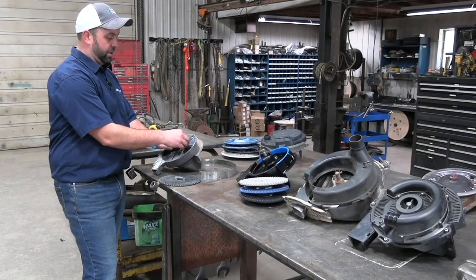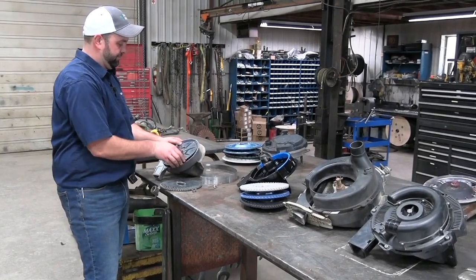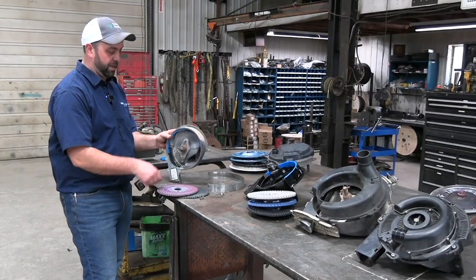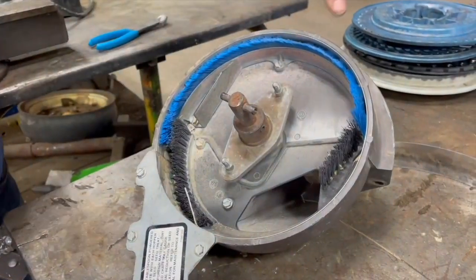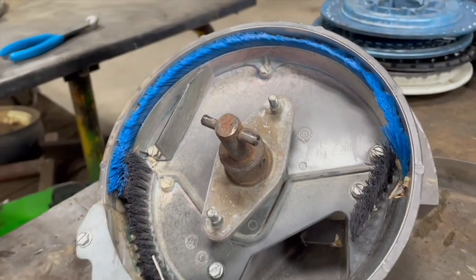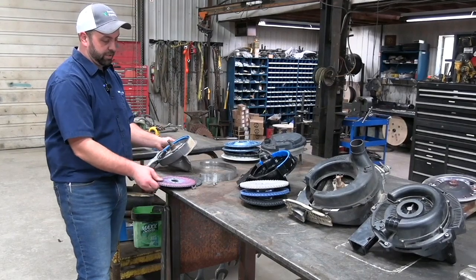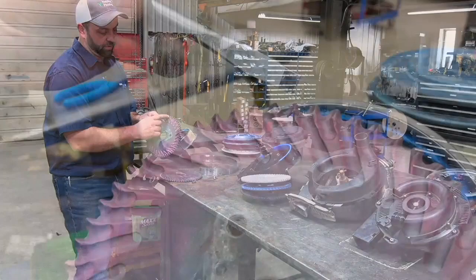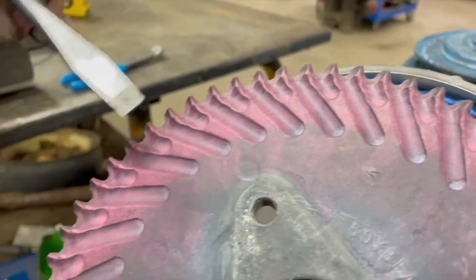One thing I want to quickly talk about as we take this thing apart here. As you can see, this meter was stored with the plate inside. Number one maintenance tip for these: always take the plates out. As we can see here, this brush is severely matted. We want to check that these are standing up nicely and that everything is just all right inside of here. As you can see, we've got two plates that are very worn. You can start to see the shape of a soybean in here — what happens is the lead into this starts to fade away and our feeding suffers.